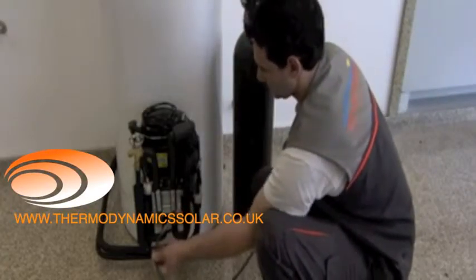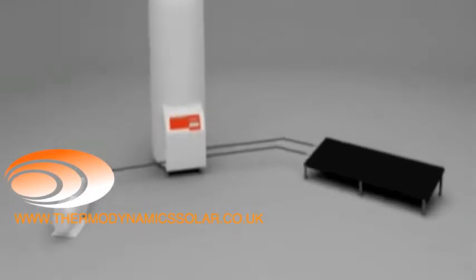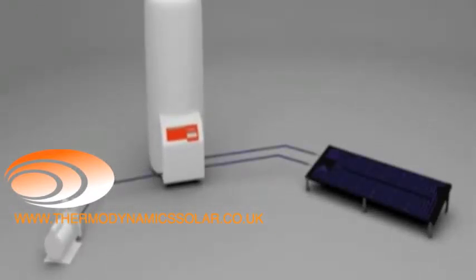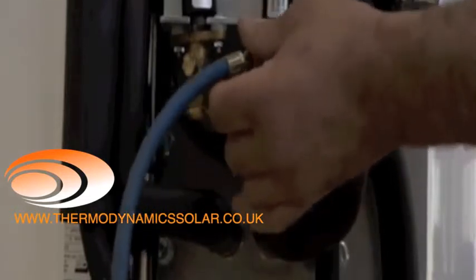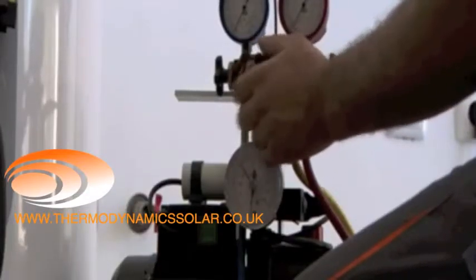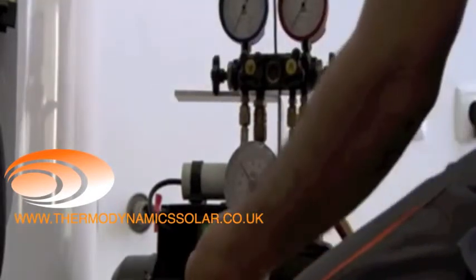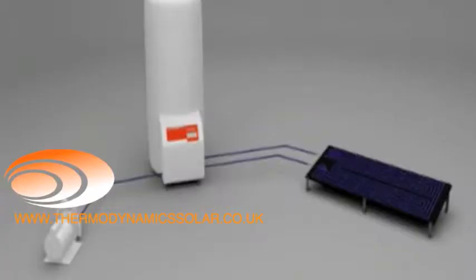Before producing the vacuum, remove the existing nitrogen charge from the pipes and panel. The purpose of the vacuum is to remove all existing air and humidity in the panel and its connecting pipes. Never use the system's coolant to purge the connection pipes. The valve should remain completely closed during the vacuum process to vacuum only the pipes and panel. The vacuum is created with a pump connected to the pressure socket or three-way valve, never to the block's pipe. Open the vacuum hose valve, observing how pressure in the vacuum meter decreases. The minimum recommended vacuum time is 20 minutes.